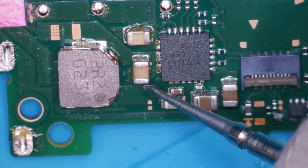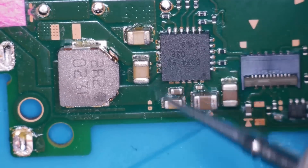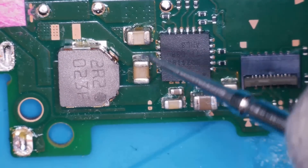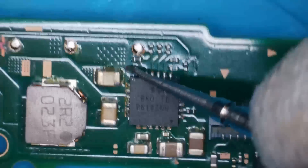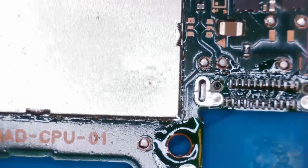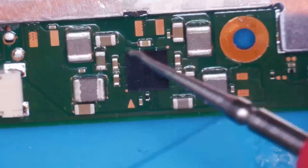Our best way of knowing this is to inject power into this side of this cap. I've got a donor board here — this side is meant to be grounded, this side isn't. The plan is to inject voltage and it should show us where exactly the short is coming from — my guess is the Max IC. First, let me inject power into that cap. I'm only going to start with one volt and one amp just to see if anything's getting hot. I can use my FLIR cam to see where that short is potentially coming from. If it doesn't show me, I'm just going to have to start pulling components off the board.